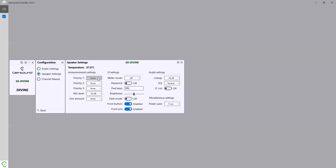What that means is: if I set channel two as priority one, any audio on channel two will interrupt whatever's playing, bringing it to the minimum level that's set, and the background audio will go to the dim level that you set here. You can have it just dim or you can have it cut clean — you set that there.